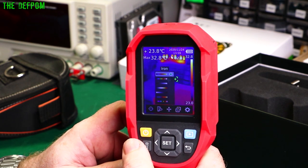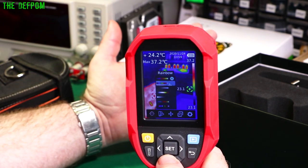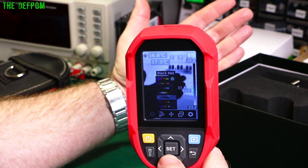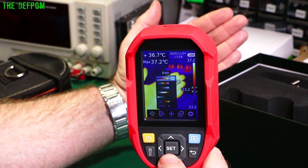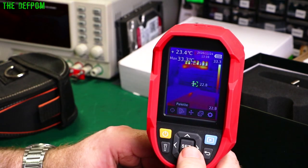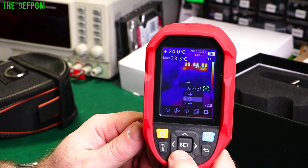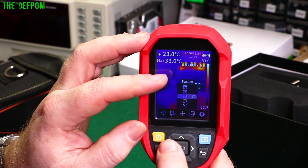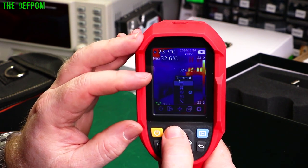Under point temperature you can choose how many points you're using and what you're actually measuring — it's all selectable. Then image modes: this is fusion, which I showed before. The very basic mode is straight plain thermal image with nothing else. The update rate is pretty good on this, though you do get occasional moments where it pauses for maybe a quarter of a second — that's it doing a little calibration. You can actually hear it clicking at the same time.